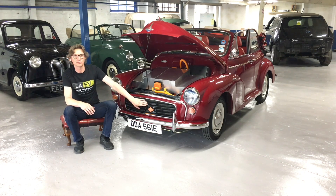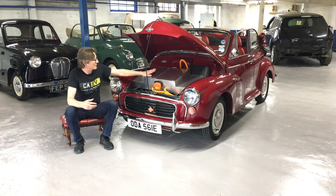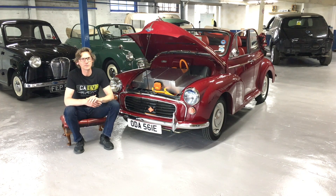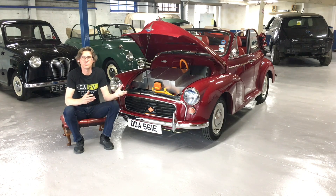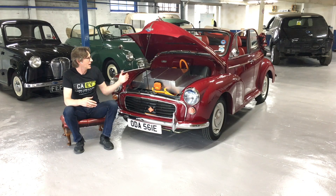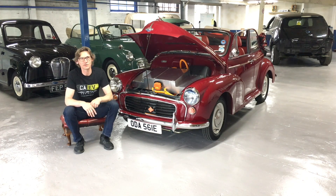That's on the front — that's where we plug it in to get it charged up. The next thing you'll see is the big box of batteries, which is a box of six modules from a Nissan Leaf. They are the 30kWh modules, but we could make it with 24kWh modules or 40kWh modules as they are all the same physical size. It has a nice big service fuse on the front to make sure that it's safe when it's being worked on.